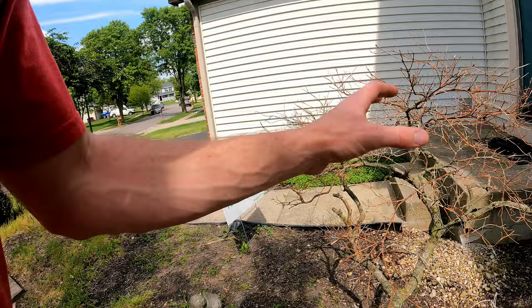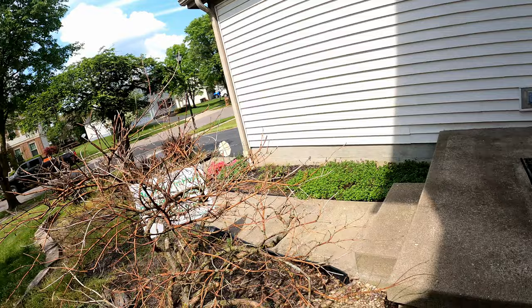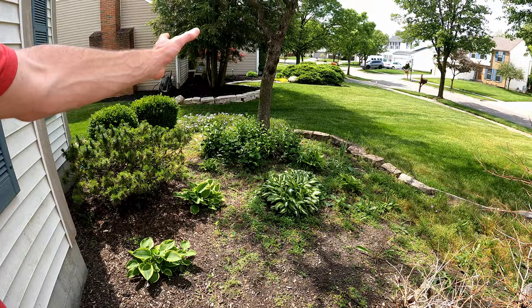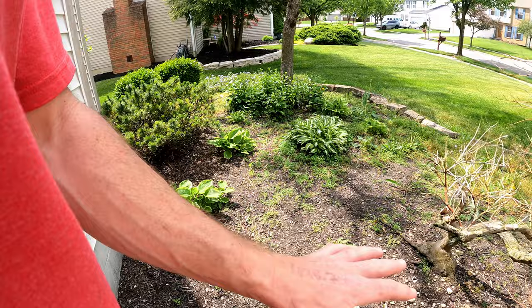Not sure what age, obviously it's a little older, but we noticed a couple things here. We've got water issues from settling of the soils. We want to get these built up and shaped, and shedding away from the home, always getting our soils shedding away from the building. So we're going to take out all the stuff, redo all this. A friend of mine does power washing. We recommend them to power wash the house, get it looking like brand new.